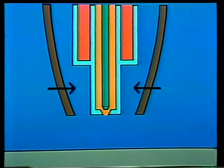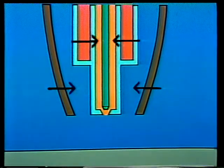Plasma arc welding is similar to the TIG process we talked about earlier. Plasma is a collection of charged particles which will conduct electricity. Like the TIG method, the plasma arc method uses a torch for welding, but the plasma torch is made with two gas channels, one for the shielding gas, which is like the one on the TIG torch, and another one that feeds an ionizing gas heated by the tungsten tip, forming the gas into a plasma gas. This is called the plasma jet. The result is a greater concentration of heat, which results in a faster weld.